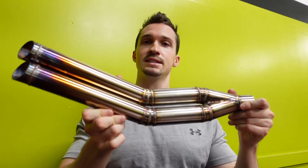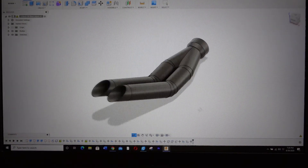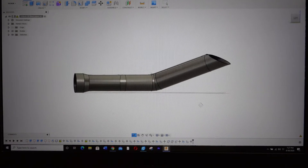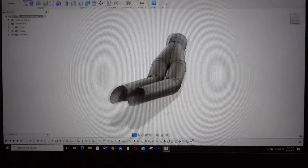I made a little small one here just as an example, but we're going to be making blast pipes out of three inch tube, which is quite a bit bigger. This is the goal for this set of blast pipes — we're going to go from a three inch to two three-inch pipes, basically splitting off into two at 30 degrees. That 30-degree cut is going to give us a little bit of space to weld all these pieces. Then as the pipes split, we're going to use some pie cuts to turn it back to parallel, and then go up a certain degree with more pie cuts. I think it's going to give a really nice look and I've been looking forward to this project for a while.